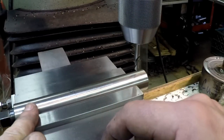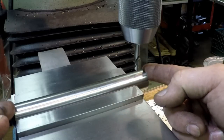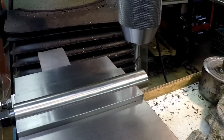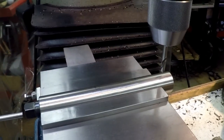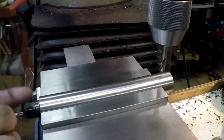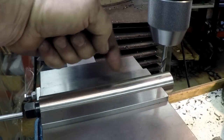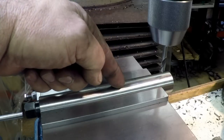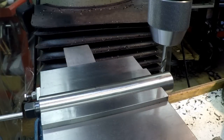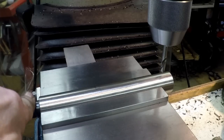I got one of the truck handle bodies in here - each handle's the same length. Over here at the stop, I have it just touching the end of the tube so I can come over with the DRO because that corner is still zeroed at that back edge. I measured this so I came over to halfway on the tube and down six and a quarter inches, and when I pop the other one in it'll be in the same spot. I just eyed it level - didn't even put a level on it.